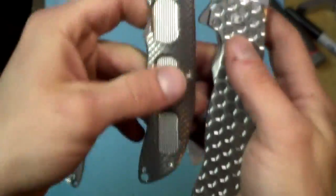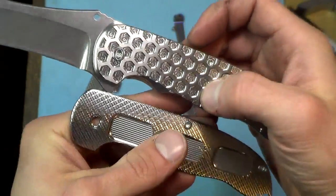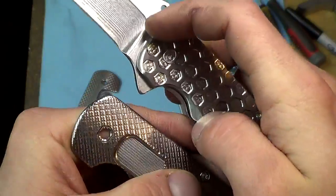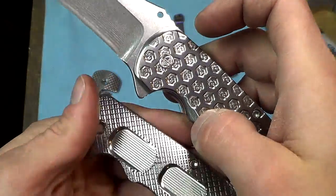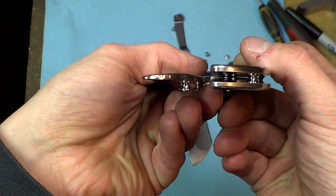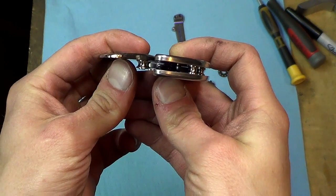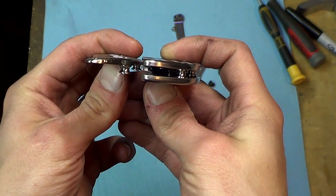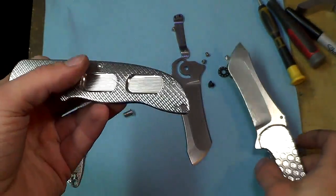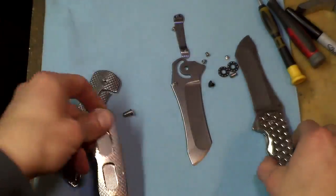Normal honeycomb handle versus the 3D handle — I got rid of the front groove just because I didn't think it was necessary in the 3D pattern, and I kind of like it without. It shaved quite a bit of weight off just contouring it like that, and it's still the same thickness material. I started off with 1⅛ inch, coded the handles to take about 5 thou off the top so that I know the tops will get cut, and it worked great.